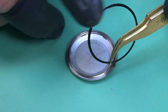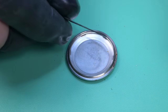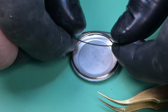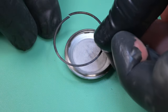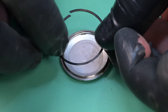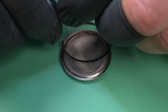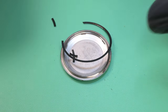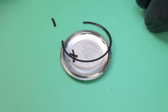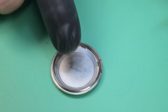Here is the case back gasket — as you can see, this is what a worn-out gasket looks like. They're flat and brittle and they break apart. Good gaskets are real soft and supple and malleable. You can see this thing just breaks apart into pieces just like that — so this watch gets new gaskets top to bottom. That's a really good shot of what a worn-out gasket on these looks like.